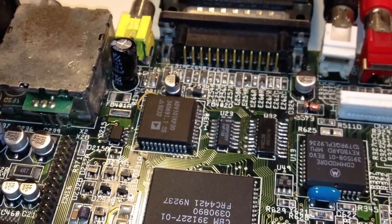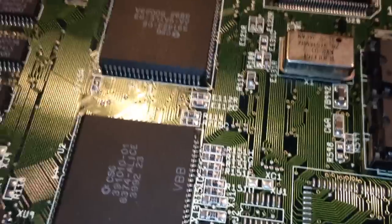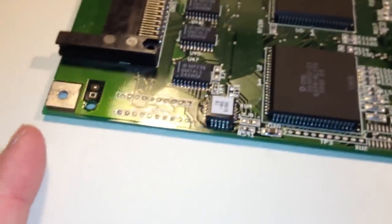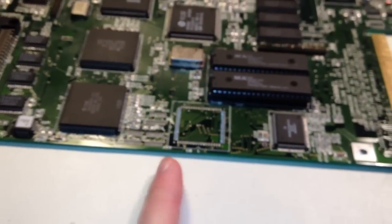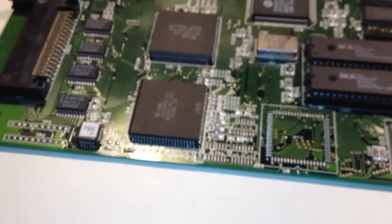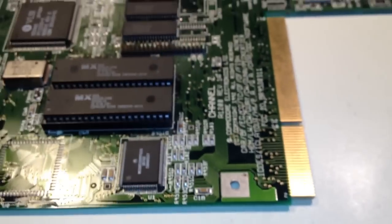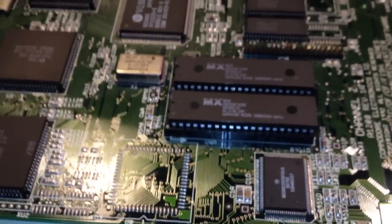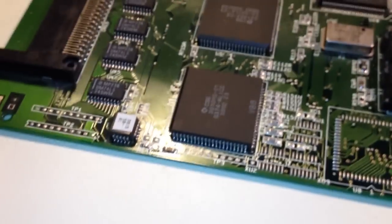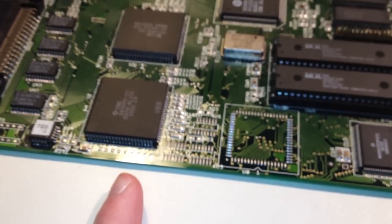So, okay, when we did that thing in ProTracker and checked on the signals on the oscilloscope, if this is the slide bar in ProTracker, it starts here and stops here, left, right, and the middle is around here. Some of those 8 data bits went off, on, off, on, off, on, or something like that. But when we look at the screen in ProTracker, the problem is in the middle of the slide bar, right? Because we move that slide bar, and in the middle of it, bam, the color switches back to black again.